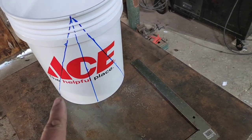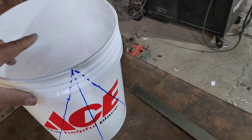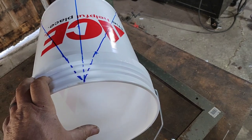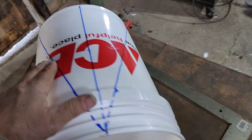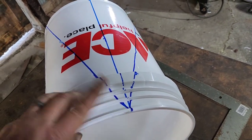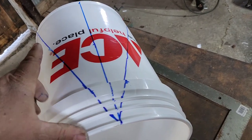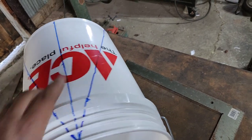And then once you got your 6 inches, draw a line. What I did is hang the tape measure upside down here and keep the tape upside down here. That way it follows the curve, and then line it up both on the 6 inches and this center line here. And then draw your line right along that tape on both sides of this center line, 6 inches.